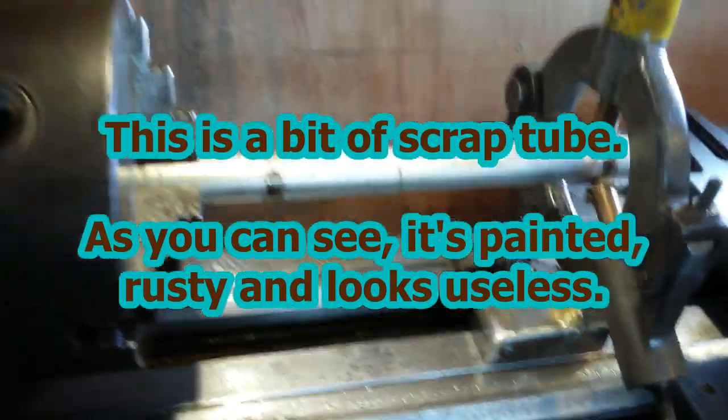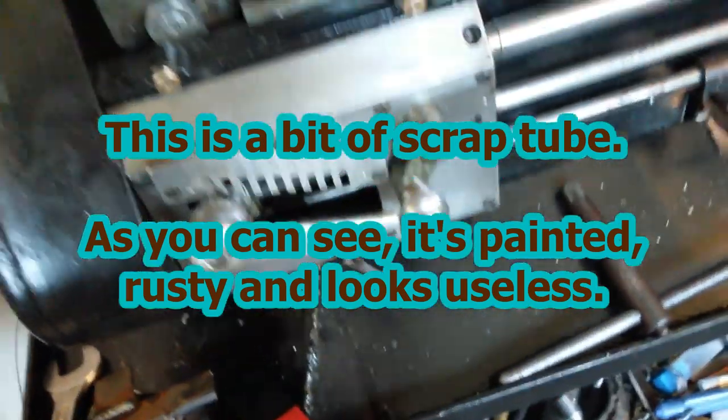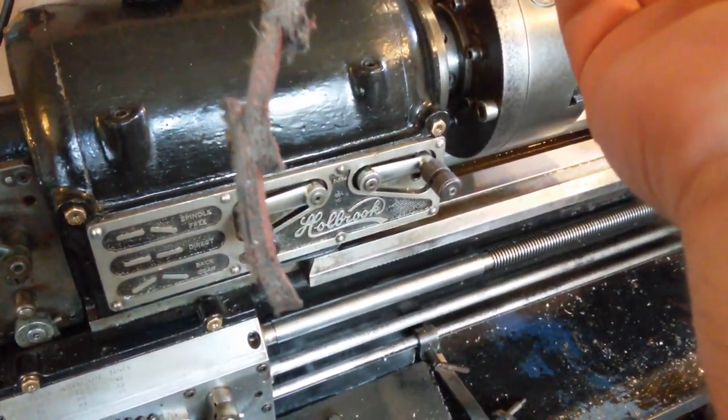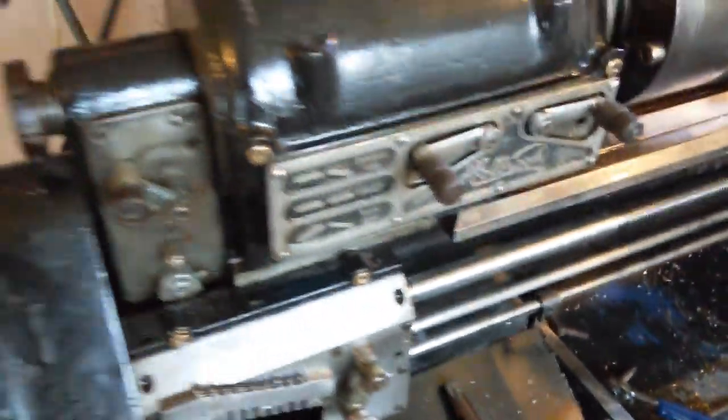I lost concentration basically because the lathe keeps on snapping its belts because a bit of oil got in, and leather doesn't like oil. It splits up like that and then rips. I also made a new bracket for the motor bracket down here, and I've put absorbent granules in. There's like a dam welded around the chip pan, and that's just where the lathe sits in, where it bolts in, and that's to keep the oil out of it.